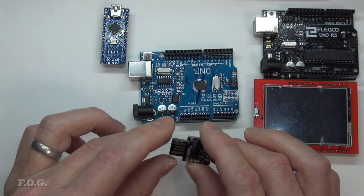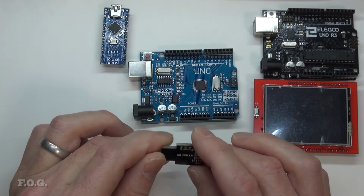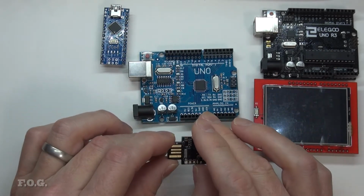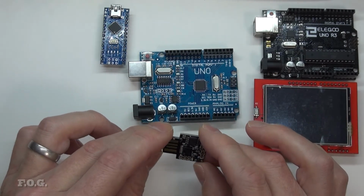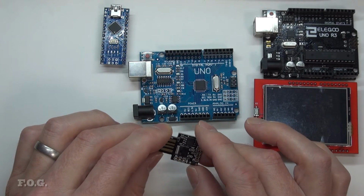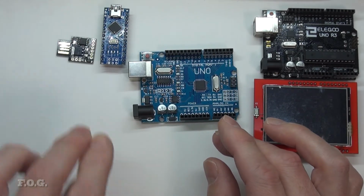And to be honest, I actually just find the whole bootloader implementation on this form factor to be quite unusable. So for me, this is not a practical something to use. I mean, it's nice to plug in and see the blinking light and do a few bits and pieces, but once you're left with 6 kilobytes of usable programmable language, which is going to be heavily compiled from C, it's not a practical thing to be dealing with.